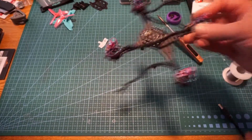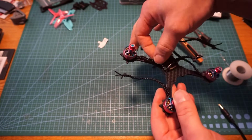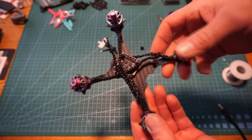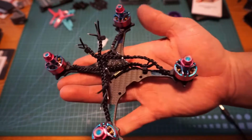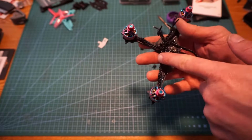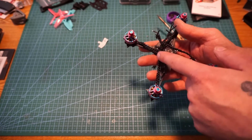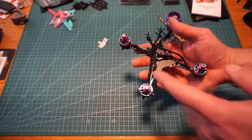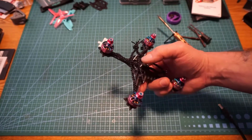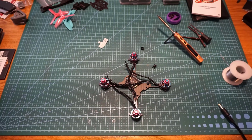It's just something I do to my drones as of, I don't know, like the last year of building or whatever. I seen it on a build and I adapted it really quick because I really like the style of it, and it also keeps the wires all nice and neat together. I do braid all my wires, keeps them nice and intact, and sometimes, you know, the prop will come pretty close to the frame, right? So you got all this extra wire and then you get something damaged on there or whatever. It's not ideal, but then you just take and unbraid it, and then you'll have the extra length of wire sometimes to go right to the ESC, and you won't have to worry about replacing the whole motor or splicing in wire and resoldering everything, because that always sucks.